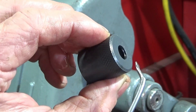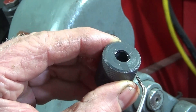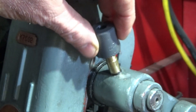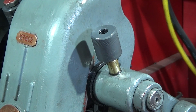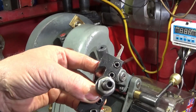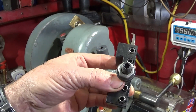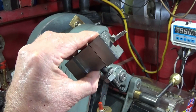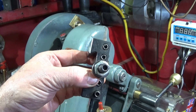You'll see that I've inserted an O-ring in the front of the bore there. To do that O-ring groove I used this tool here — I made that one up out of a piece of HSS tool steel and ground it up on the lathe for doing small O-ring grooves like this one.